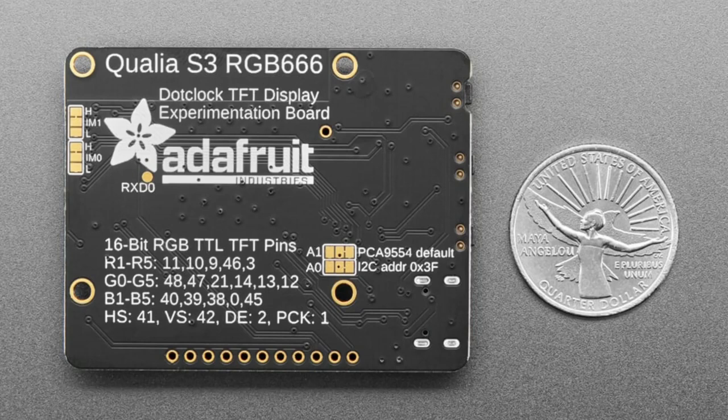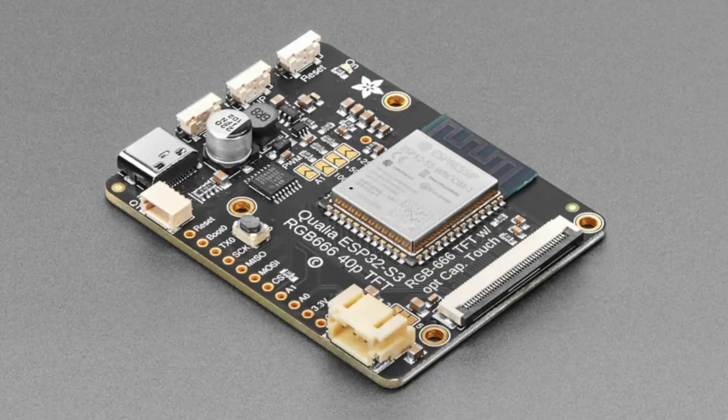So we did a little example demo of that. I think in the product description, we linked to the Cinepak demo. But basically, you want displays up to 720 by 720 or 800 by 480. These displays will be able to be run with this device. They just snap onto the end. And then you also have a STEMMA QT connector, so adding I2C. So I2C pins are available, and two buttons that go through an expander.